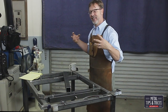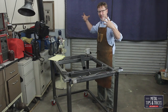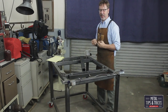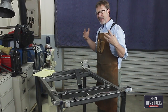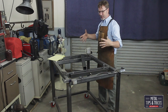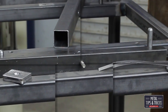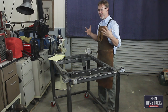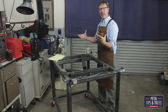The rigidity, of course, is the stability that is going to keep the granite surface plate from crashing down, but you also have to put flexibility in it — and those are two words that don't fit well together. They have to, because we need to support this granite surface plate in such a way that it doesn't twist, but we can also level the whole stand. And we do that first by looking at how do you support something to keep it from twisting.